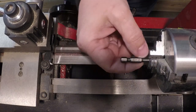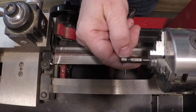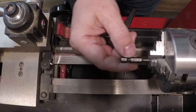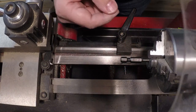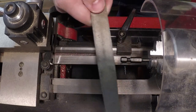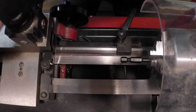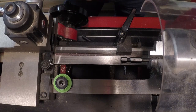The problem is the tips on this shaft of the bit are too high, so they just need to be knocked down. What I'm going to do is take a flat file and file that down so it'll fit into my chuck. I'll keep my chuck here so I can pull it out and occasionally check it to make sure I'm at where I want to be to slide that on.